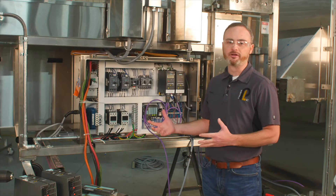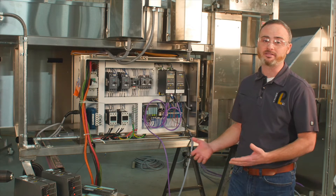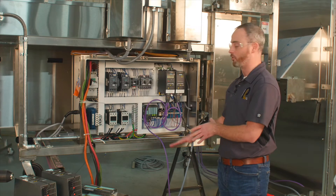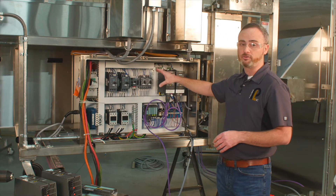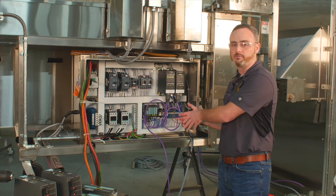We're fortunate here at the equipment donut factory to have the fryer up on sawbucks — easy to get to. In the store it won't be that way; it'll be on the ground. You'll have a door that opens up. This is the fryer side of the machine where the plugs go. You'll find your electrical enclosure with the main disconnect on it, and that's where you'll get access to the machine.